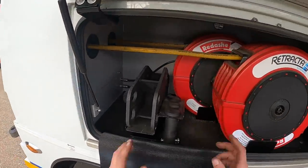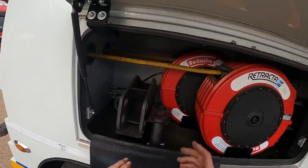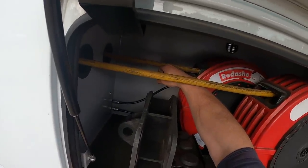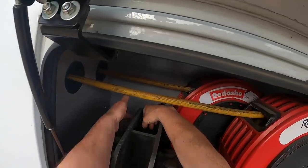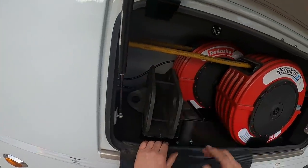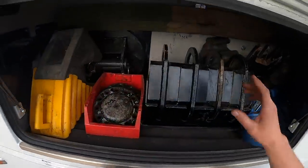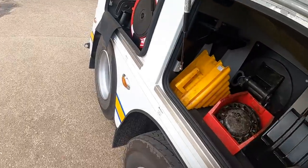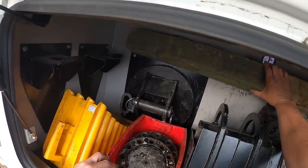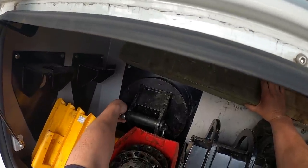In this locker we've also got an adapter that fits onto the crosshead of the truck. It's got two purposes - we can actually attach the fixed tow pin into here, which is a big retaining pin that keeps it located. And at the top that's where the fifth wheel coupling connects in. The fifth wheel coupling works much the same as a normal tractor unit fifth wheel - it's got jaws where the pin locates into, and behind it we've got a heavy duty pin to keep it all in place.